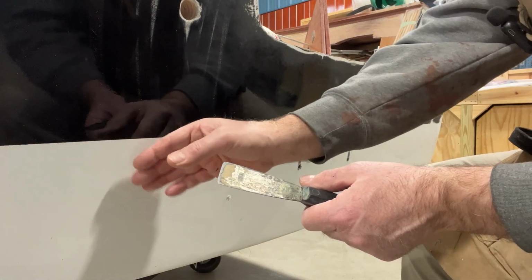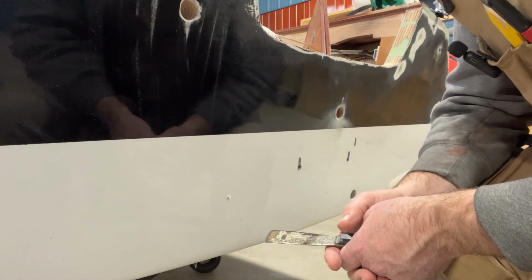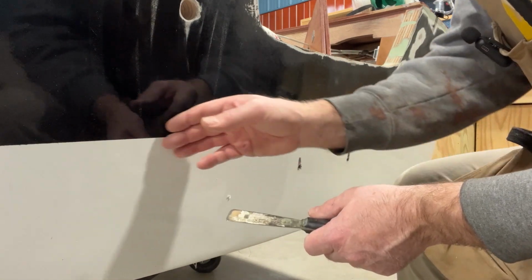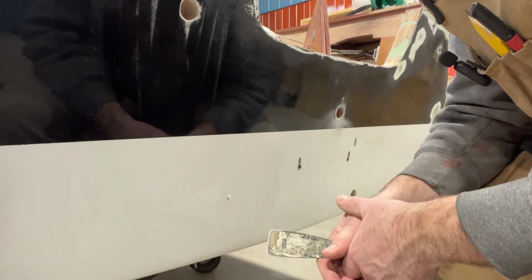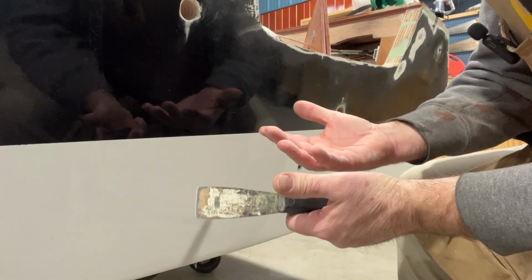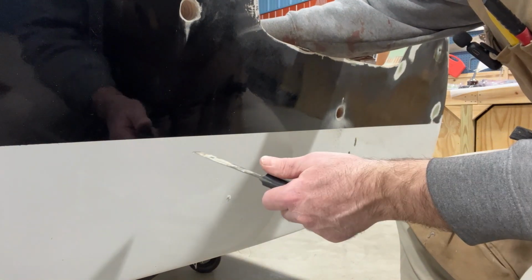And this goes all along the water line up and over here. So what will probably happen is it just didn't get enough glass in there. So I'm going to have to grind down these hollow areas, and probably will find that it chips just like over here, and address that before I move on, because you have to get that adhesion all the way on the boat in the transom, or you'll have a pocket, and water could go anywhere. I mean, even if I had a tiny hole in the inside, it would find its way into those areas.